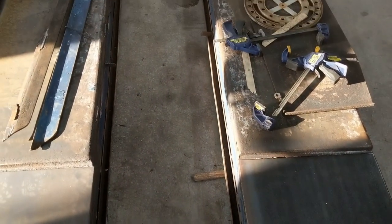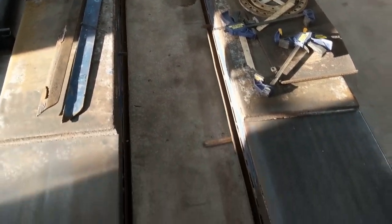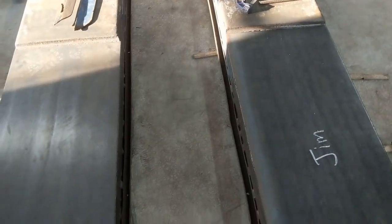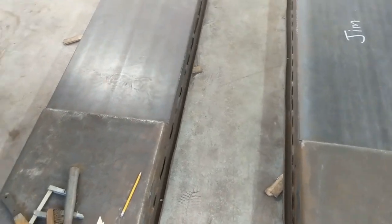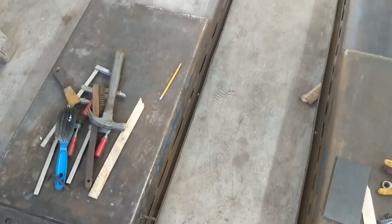These channels are really awful — they're rusted and bowed out. It was really bad on this side. I was able to get the rust out, but there are areas where it's much tighter and it's starting to swell — still too tight of a gap to puncture through. So I priced it out and I'm going to replace that channel. It's about $70 worth of materials, so it's kind of stupid not to. I'll be able to cut it all off clean and have brand-new channel that's not all warped.